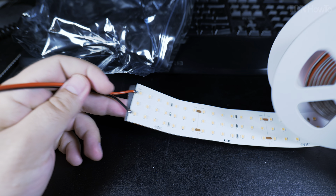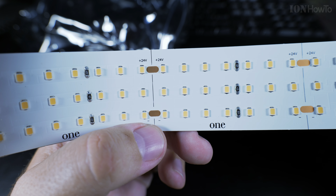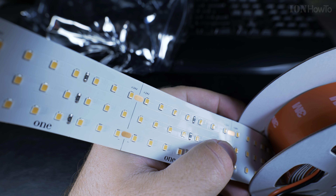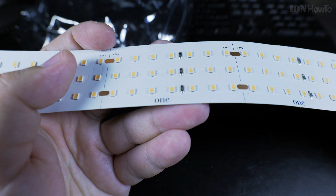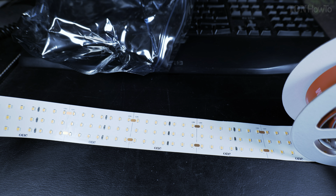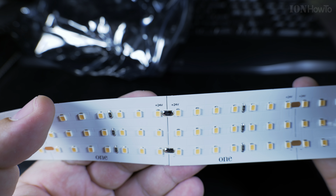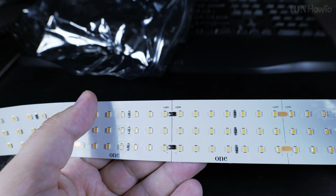This is the LED strip — three LED rows — and you can cut it at these marked points. I didn't cut it at the midpoint since it's two meters; I split it in half — one meter on each side for the desk lighting. Then I split that remaining half in half again: two 50-centimeter strips to install on custom-made DIY LED panels. At the 50-centimeter cut point, instead of copper pads you see soldering, so you can just unsolder those pads to split it without cutting.